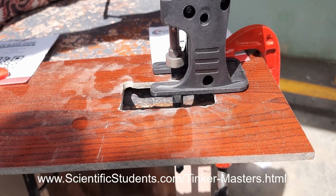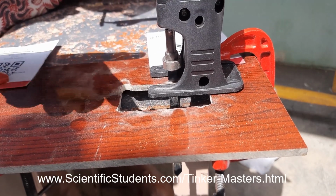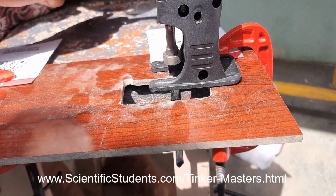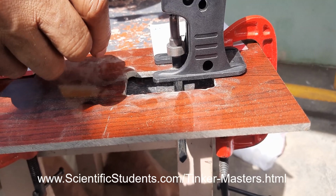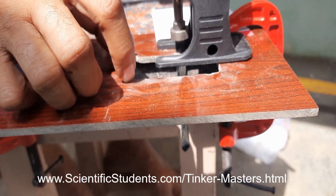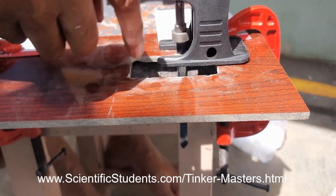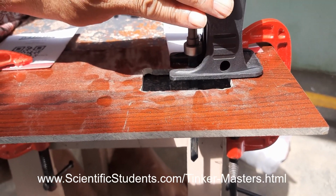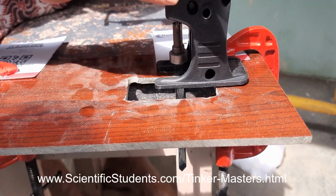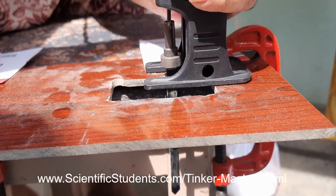I am tinkering a new project today. In this project, I wanted to install one of the energy meters here. So I need to make a rectangular slot hole here with 85 and 45 mm dimensions. So I made some 4 drills, and then we recently bought this attachment for my drill machine. This attachment, see how nicely it is working.